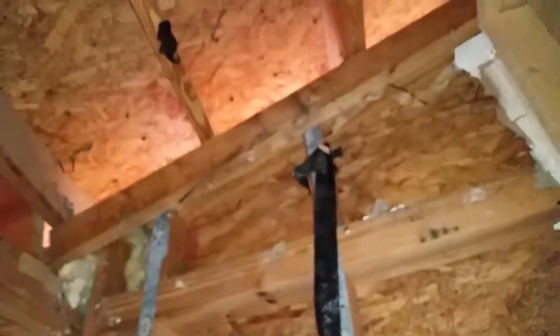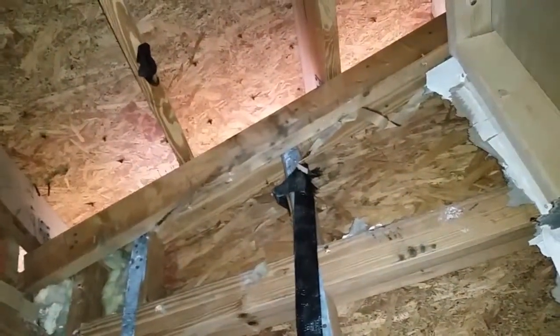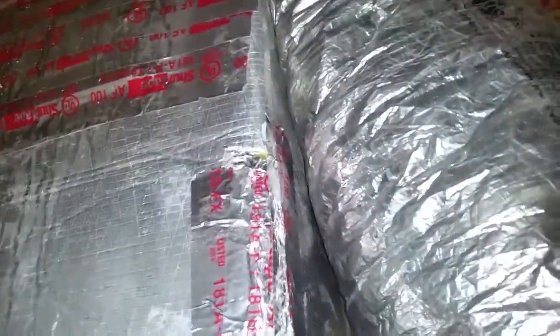You've got that open to the outside, so as soon as you do that, the hot air that's in the soffit comes up that rake, puts that hot air in there, and gets this unit leaking — air blowing against that wall. You just need to wrap this unit.